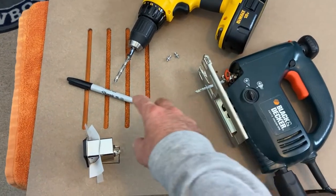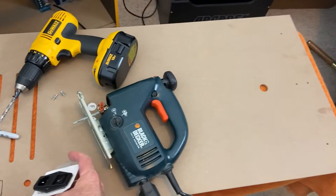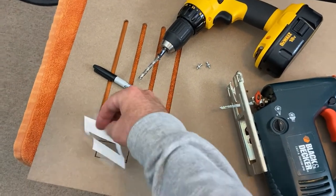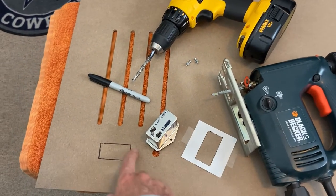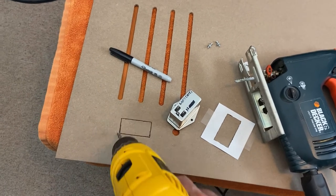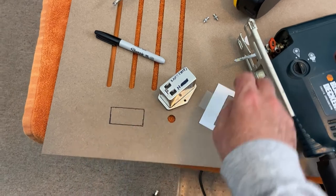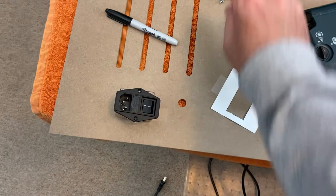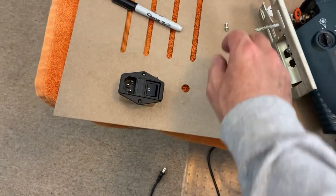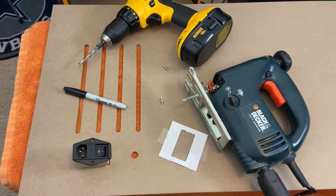We're near the end of our journey. The last part is attaching my EMI filter here — the power plug from the wall goes in here, on the outside of the back panel. I've made my template, cut it out, and laid it on my back panel and traced it out. I'll take my drill and drill the four corners, then take my jigsaw and cut the four lines so the piece drops out and the EMI filter slides right in. Then I'll take these number-four screws and nuts, attach it to the back panel, reconnect the wires from the power supply, and we'll be done.